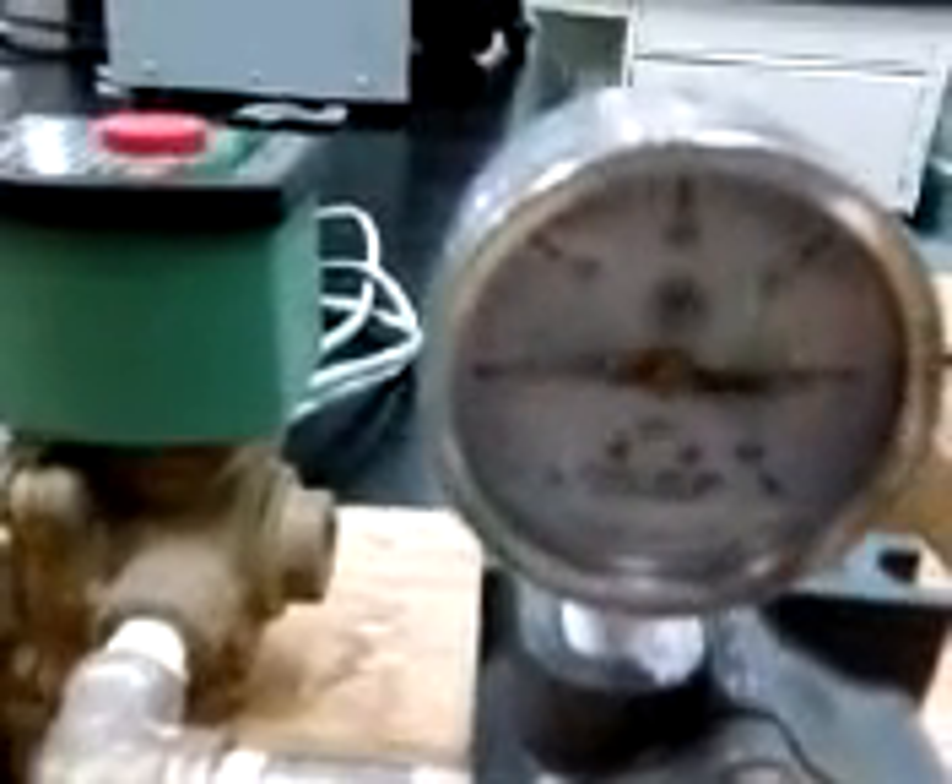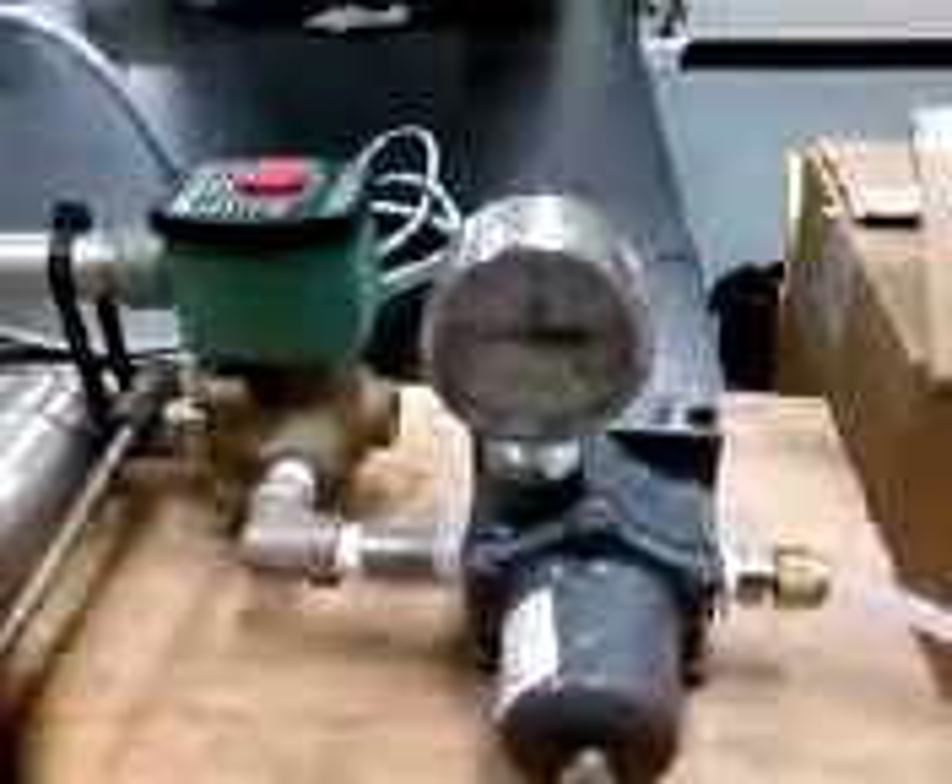Let's power it up again. I'm at close to 4 psi, and I'm going to try to go a little bit higher but not too high — that will cause trouble. It's shaking too much now. I'd say I'm averaging about 6 psi. You can see right here that everything looks like a blur — the piston is moving back and forth and it's hard to tell where it is.